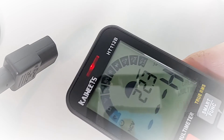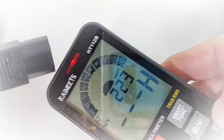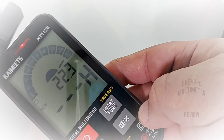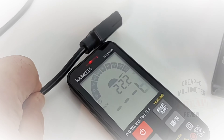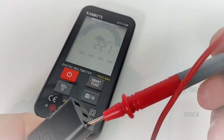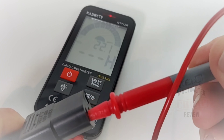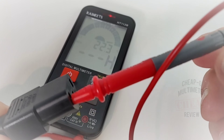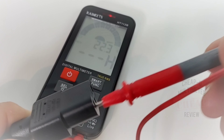We're in NCV mode right now — all you have to do is put it to a source and look at that, it is sensitive — oh so nice, so sweet. In live detect mode, rather than NCV it's basically a live probing function, and when you hit the circuit it tells you it's hot with a nice visual indicator as well as an audible. Good stuff.